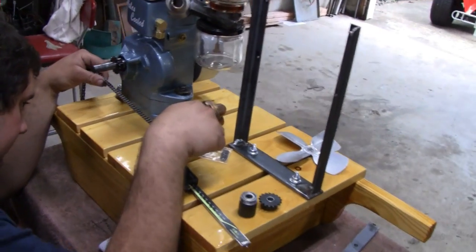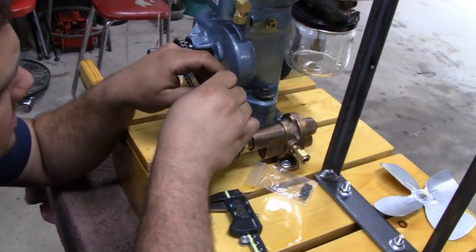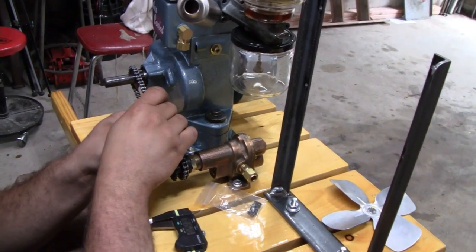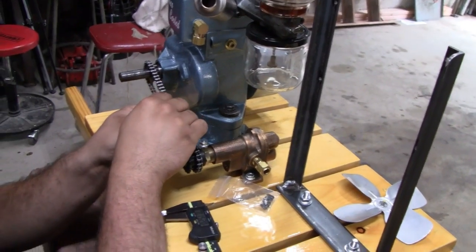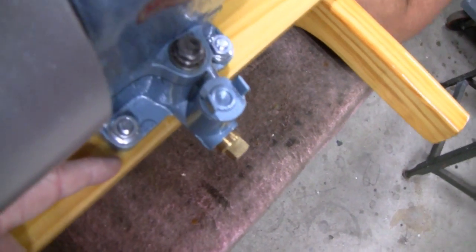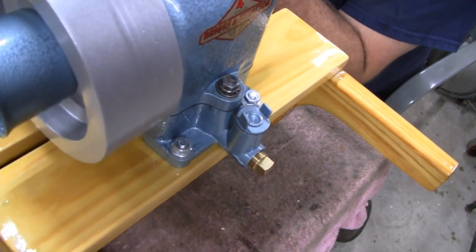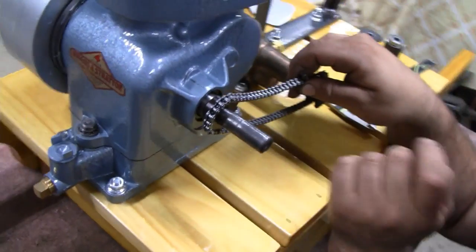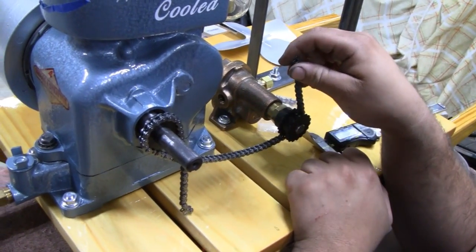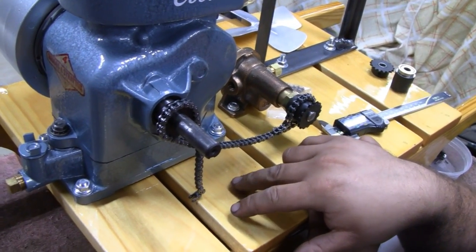What he's doing now is hooking up the chain. I bought some half links — I'm going to put one in there. Even with a half link it's going to be just slightly sloppy, but we didn't want to put big elongated holes because we just don't have the room. The bolt is less than a half inch away from the end, so you really couldn't elongate it. We can elongate it maybe just an eighth inch or so, which will take up the little bit of slack. It'll be fine — we don't need to make it tense like a belt.